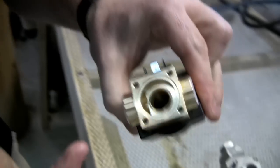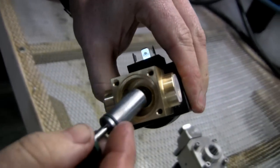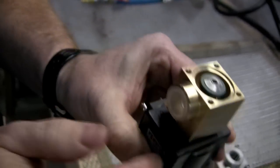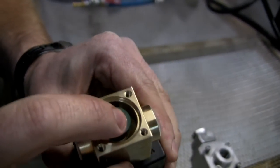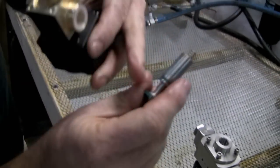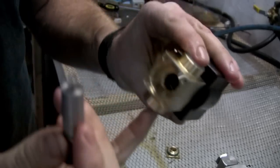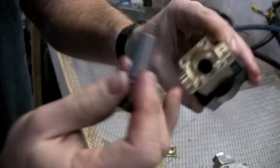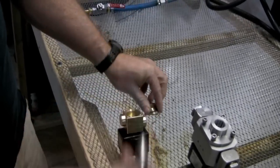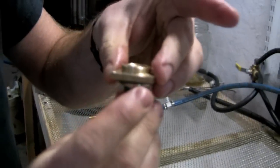That right there is the one moving part that actually moves up and down. If you look inside the valve, what happens is that this goes in there and it moves. As this electromagnet is energized, it pulls it up and closes off. As it pulls up, this seal here closes off around there and closes this port off, but allows this port to flow down through here. And as this is in a relaxed position, it seals off against that bottom port.